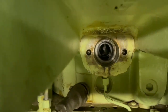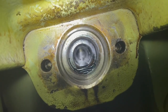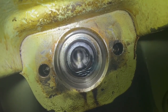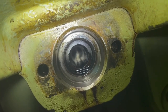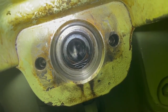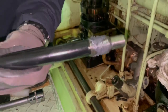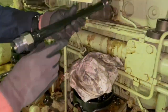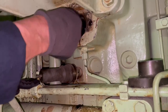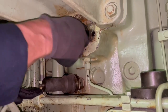From where we removed the threaded piece, we will have to inspect and turn the injector in such a way that it is aligned for installation of the threaded piece. We turn it slowly to get the exact place. Yeah, there we have it in line. The threaded piece is ready with threads lubricated with Molykote, and we gently screw it in by hand — later we will give it a torque tighten.